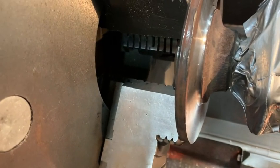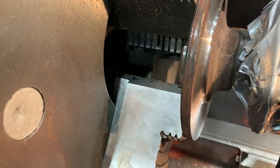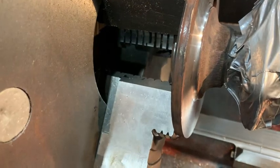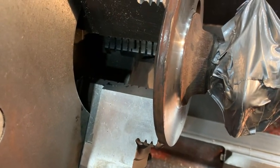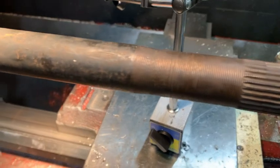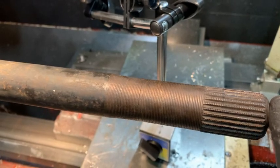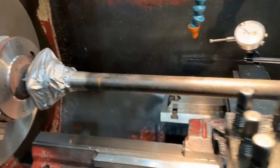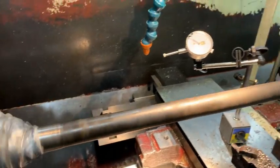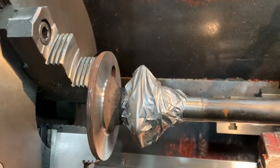So when I go to do the holes, I'll grab right here on the seal surface so it runs true. Everything should run true — dial in the spigot, make sure the face is flat, then poke the five holes in. These will be ready whenever he needs them. The reason I hate axles is that if you look at the spline right now with my center in it, this spline runs out to that center probably at least 10 thou. These things — nothing ever ran true on them, they're always terrible. I hate these things.